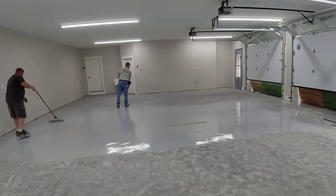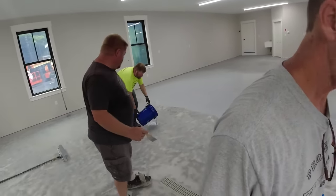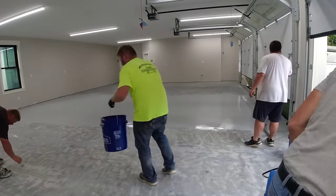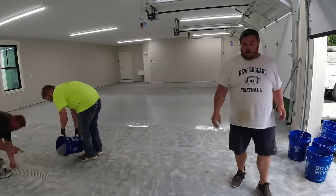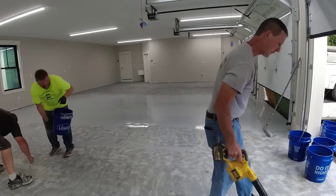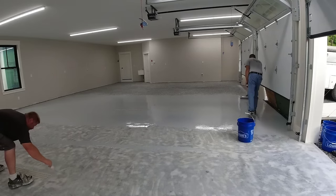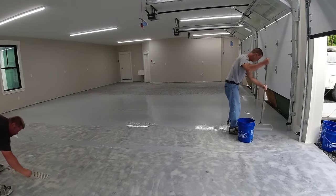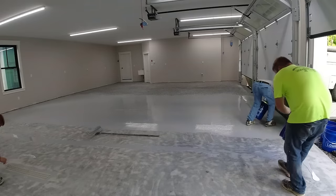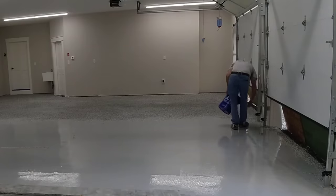You can spend a little more money, learn how to do this properly, or hire somebody like us and have a floor that's going to look really nice and last for years. This is definitely an investment in the garage and it's going to make it worth more money in the long run. There are steps to doing this and you've got to do them properly — knowing how to mix it, how long to mix it, how long you have to work with it, and how thick to roll it down. I've got a training link in the description if you want to learn, whether it's to save money or even start a business.